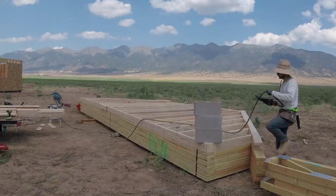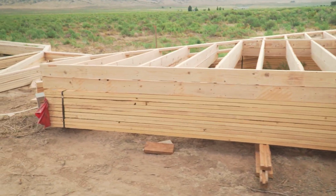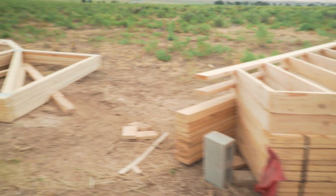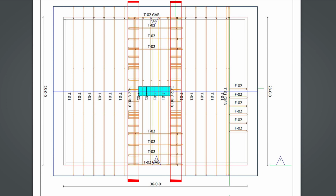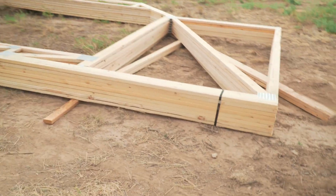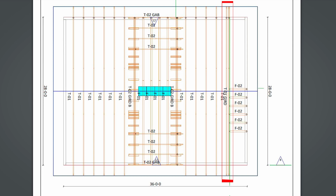Underneath are the main trusses. So I think there's about 12 of those, and we might put those up first because they're only 350 pounds each, not 850 pounds like these big boys, which are the girder trusses. They're going to have the sidewalls of the dormers built in, and then we'll build the dormer out on top of that. And the bottom two plies are the girder truss for the staircase.